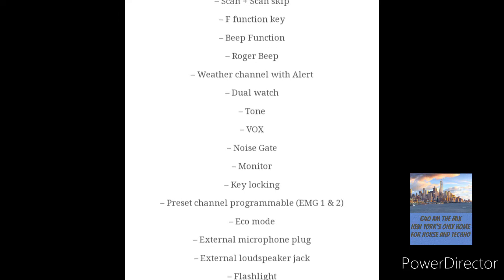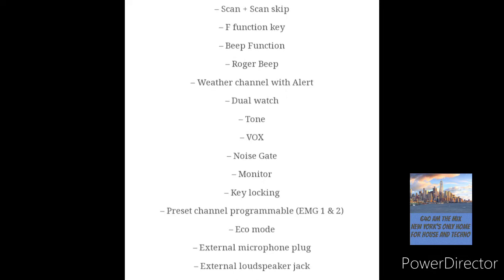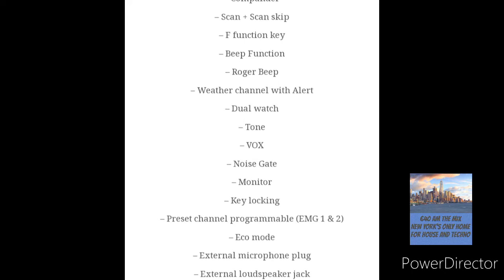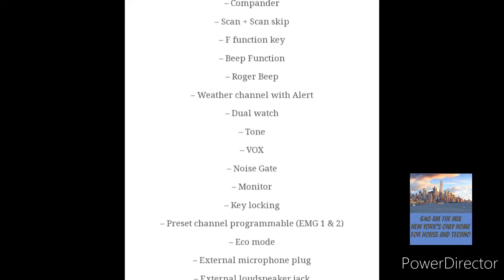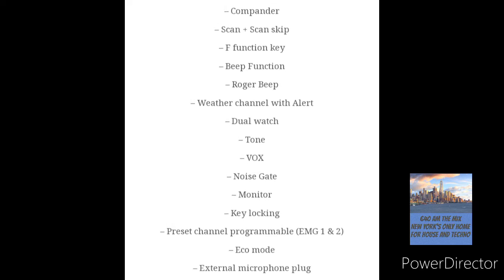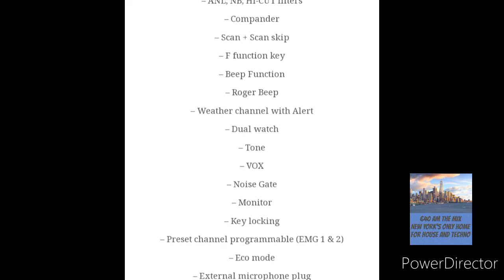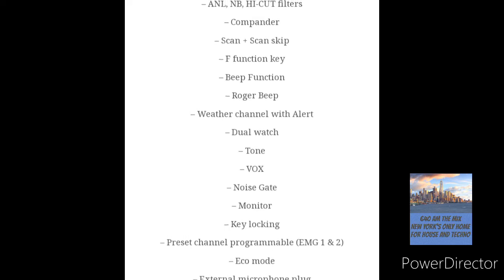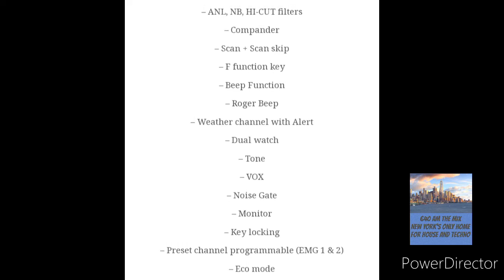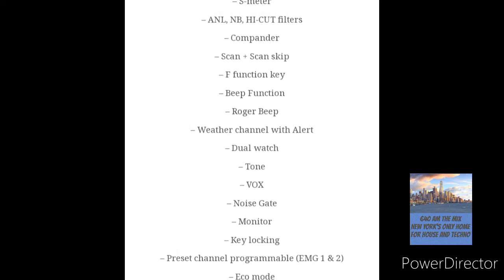Let's go down some of the features. It's a 40-channel AM FM. It's got an up-down button on the side, a manual squelch and ASC — the automatic squelch control — which I reviewed on the President Thomas FCC and works great. I love that feature. It has a multifunctional LCD display with a lot going on — a frequency display as well as a channel display. It'll show both the channel and the frequency.